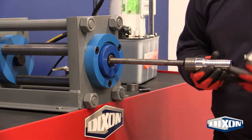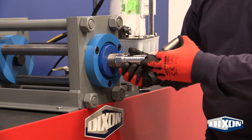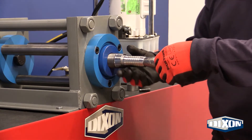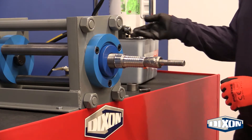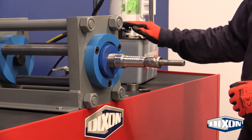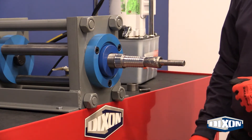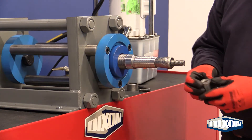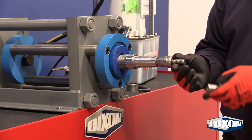Place the top end of the stem into the push plate. Following the stem, push the correct plug into the shank end of the stem. Flip the switch on the hydraulic pump to the hold position. Press and hold the foot pedal until the top end of the plug is covering a small portion of the rod threads.